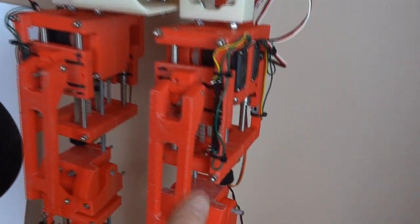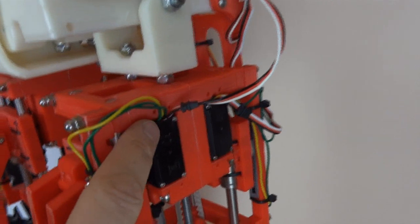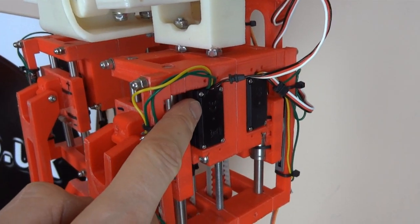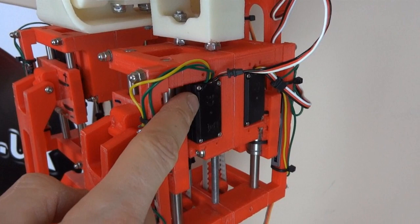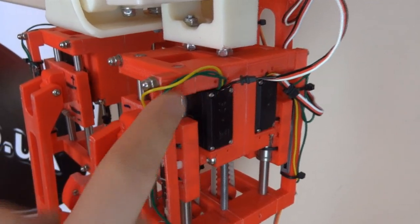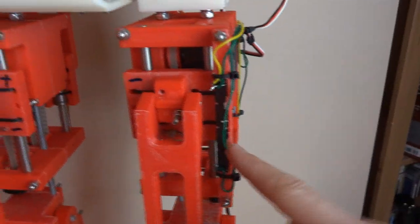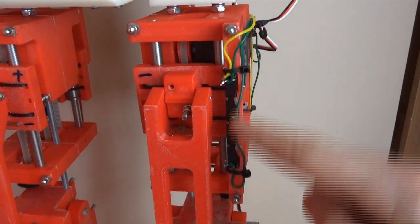The thing you can see on the front here is the potentiometer, which has been taken out of the rotary pot from inside the servo. These are normal RC hobby servos — the potentiometer for feedback has been taken out and put on the outside, and I've turned that into a linear pot so they can measure the linear position of these actuators.